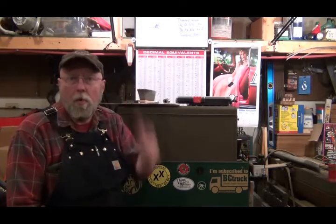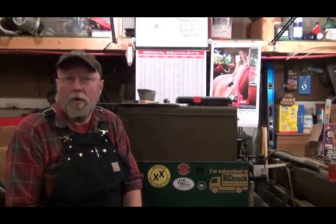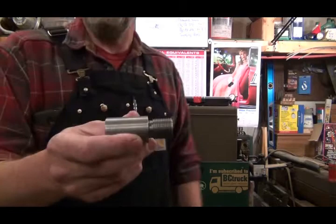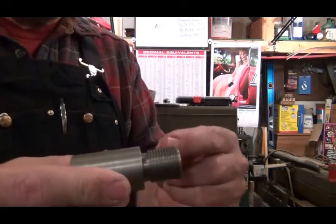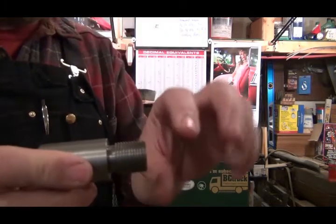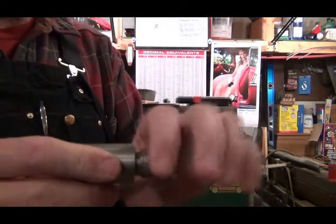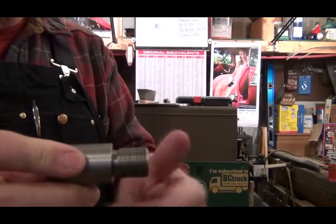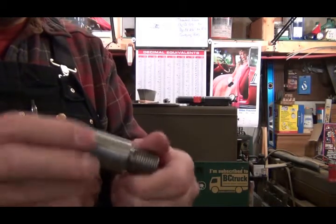So I started — I made my one piece that I have up here on my board, using the method that someone told Tom Lipton about and he showed us how to do it. So here is basically the mandrel that has 7/8-14 thread here. That's what I will thread in my nut that I have to make onto this when I cut the flats to make it a nut on top.